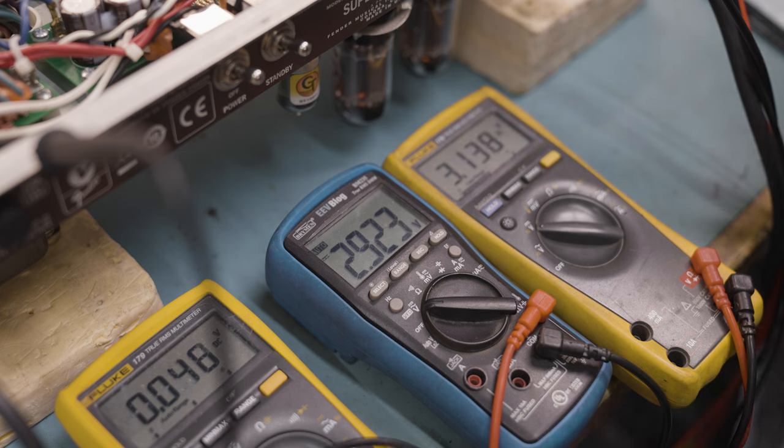As long as they're roughly matched and they're roughly within a few percent of each other, that's a good thing, because it means you get a slight bit of imbalance, which adds a little bit more harmonic flavor, a little bit of difference to the tone. And that way you're not having things quite so perfectly in alignment like what you would with, say, for example, a hi-fi amp.